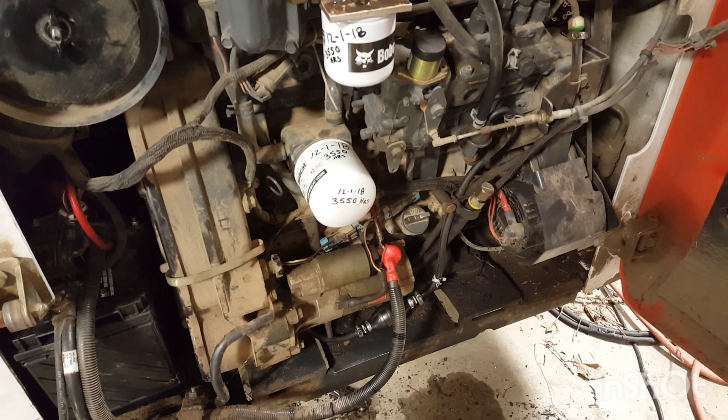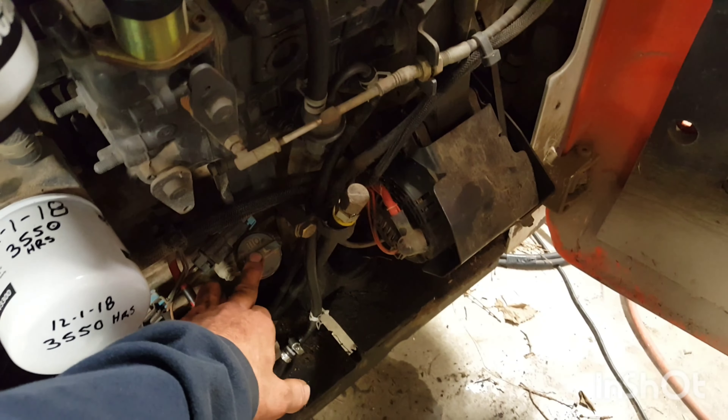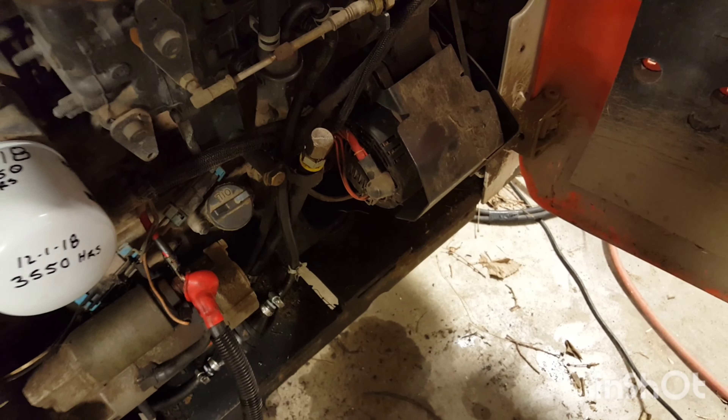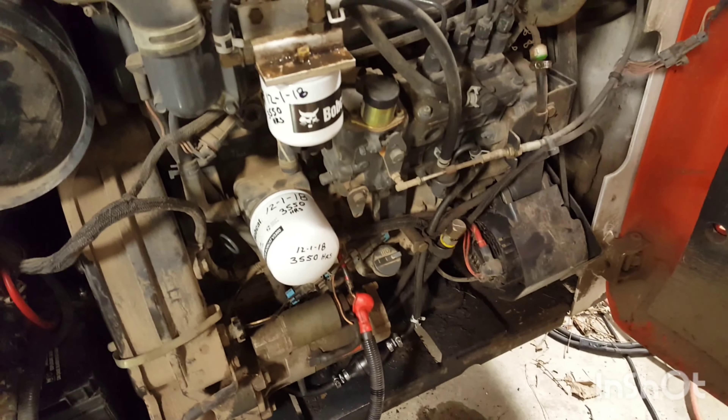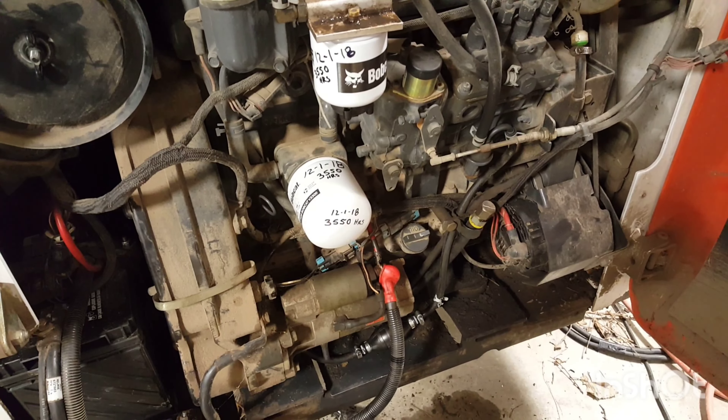They're showing two gallons, but there's your dipstick, oil filter, fill tube, and your drain hose — just comes out and you drain her out. I'd recommend starting the machine first and getting her warmed up. It doesn't take as long then, unless you've got something else to do — just start draining it and walk away.